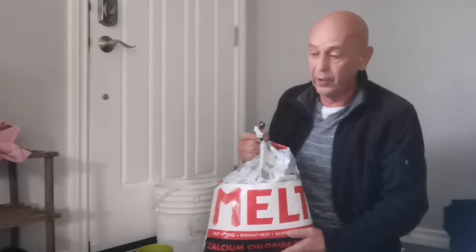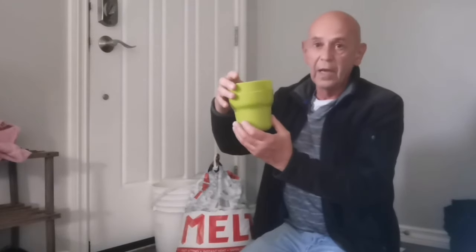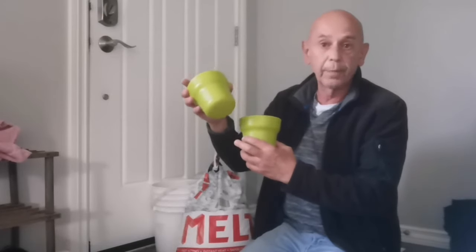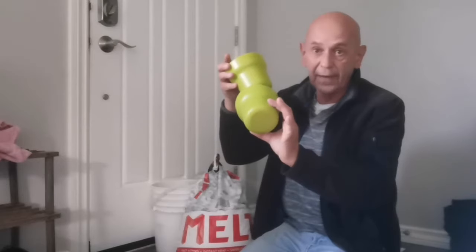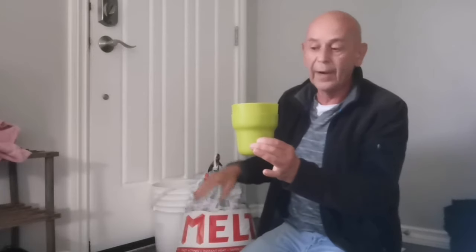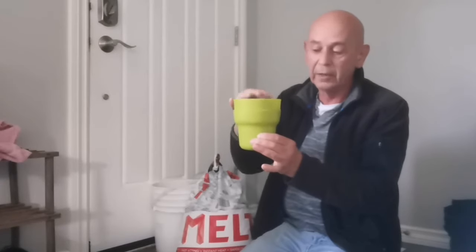So what do we do with it? The DampRid product is really a rectangle or jar-type product — usually two items that nest into each other. The premise is that the bottom of the first container has holes for the water to drip out, and you put that into a second container with no holes. You put your calcium chloride into the first container, it draws in moisture, eventually becomes saturated, starts to melt, and the water collects in the bottom, which you then dump out.